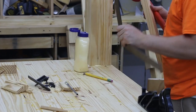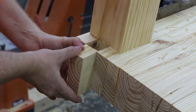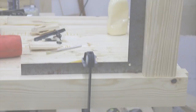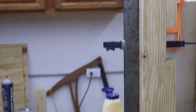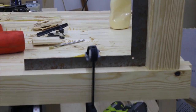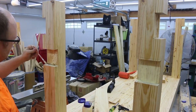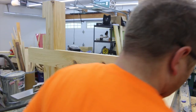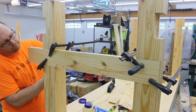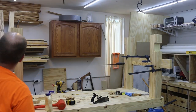Now I'm gluing the legs into the tabletop — fairly straightforward, using a square and some clamps to hold everything in place while the glue sets up. There's a little filler piece since the method I used left a gap; I just glued in a filler piece to make the tabletop whole. With all four legs glued in, I'm attaching the stretchers. These will keep the table from racking as I work on it — I glued some oversized pieces into the half-laps and will cut them flush later.